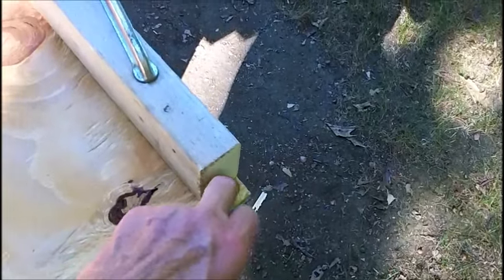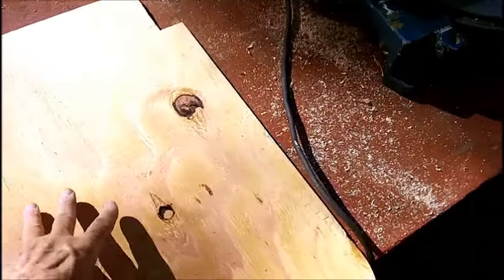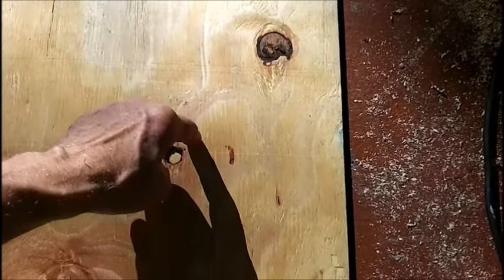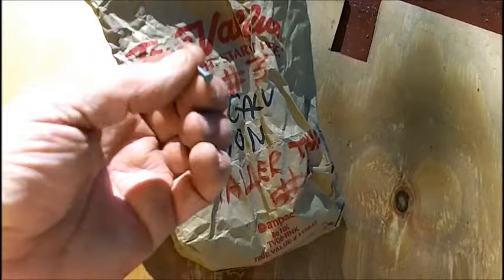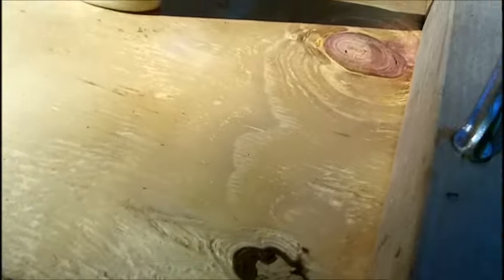What I've got here is a 2x3 clamped in. This allows the half inch. This is upside down now — you're looking at the bottom of it. So what I'm going to do is nail this in place, but before I do I'm going to mark it, then glue it and nail it. The reason I say nail rather than screw is because when you drive the screws in, they're going to go a little below the surface of the plywood and you'll have little splinters sticking up, which wouldn't be pleasant to work with. So a nail will give a better finish on the bench.